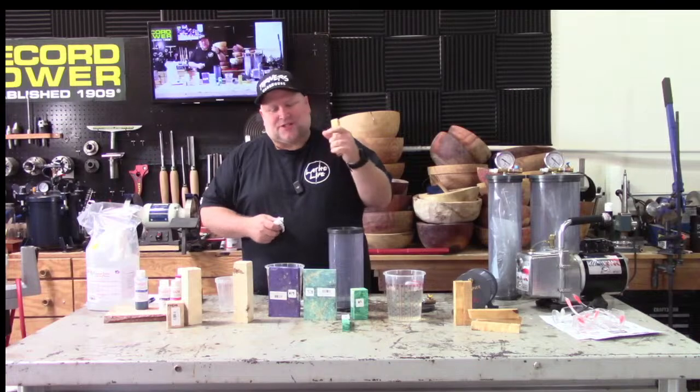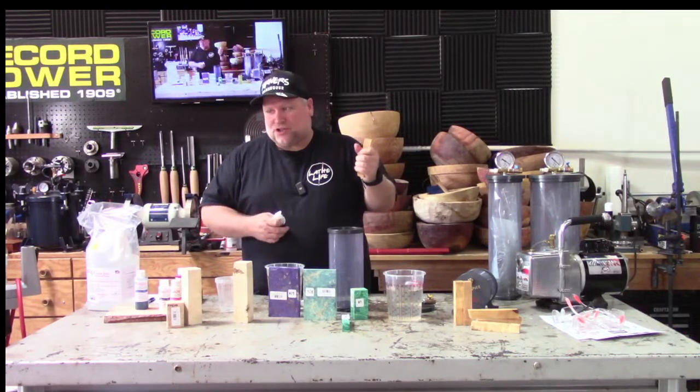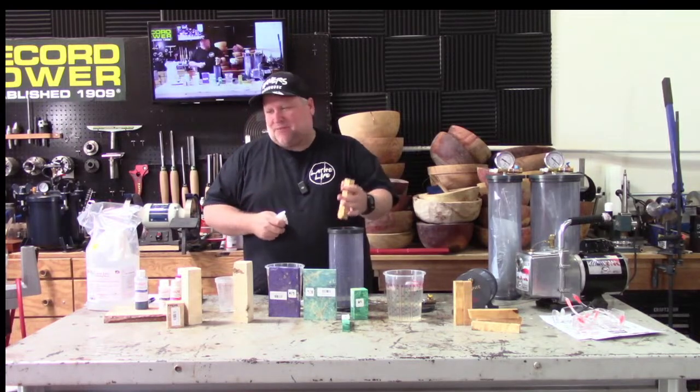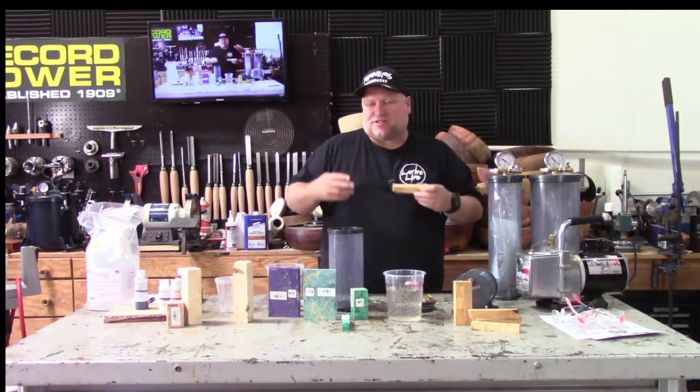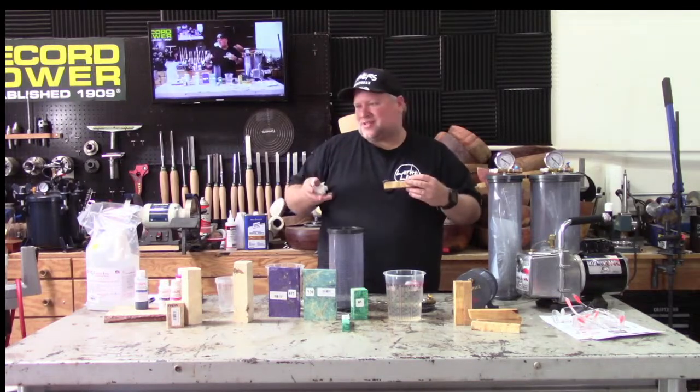So there's that factor that there's a lot of pieces. Plus there's probably whatever glue they use, right? So I think that's what causes the problems. It stabilizes fine typically, but a lot of times if you dry it too fast or too hot, it'll crack or warp or twist.